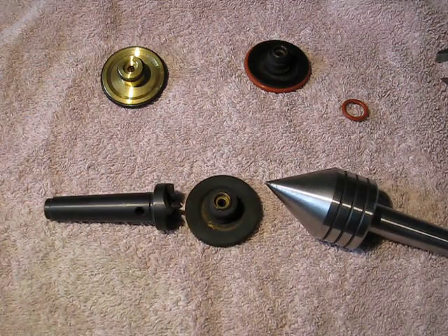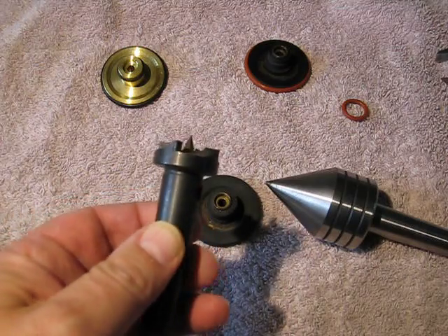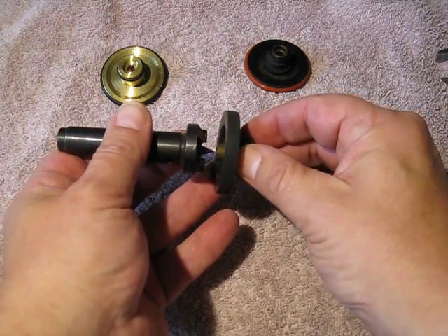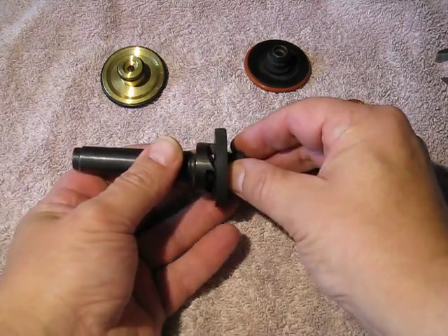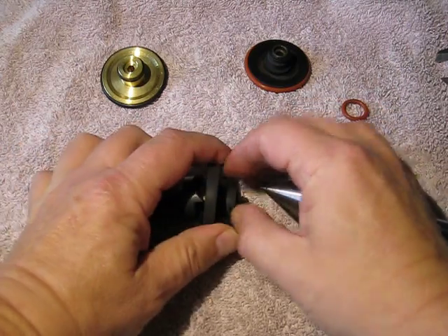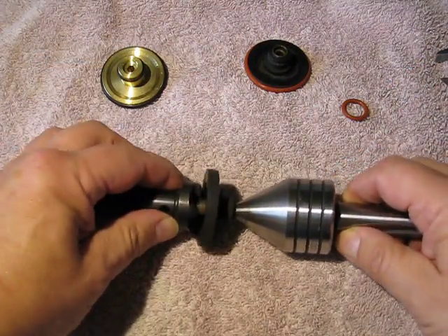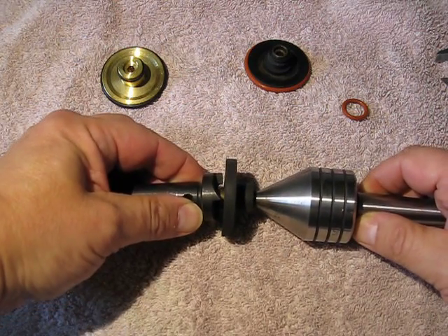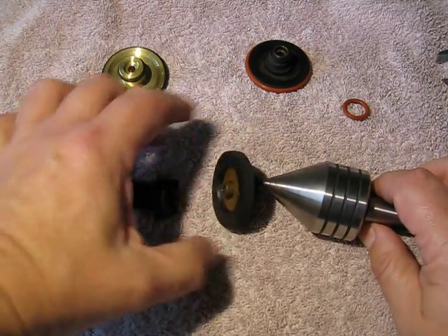So bear with me, I'll describe it to you. On the headstock you're going to have one of these little suckers right here. Nearly every lathe comes with one and it's going to be mounted inside like this, and you'll note that nothing touches the rubber whatsoever. On the other side we're going to have a free rolling cone like this, and this is going to be mounted inside, concentric on the lathe once you get it set up, and you're going to turn this at medium speed.